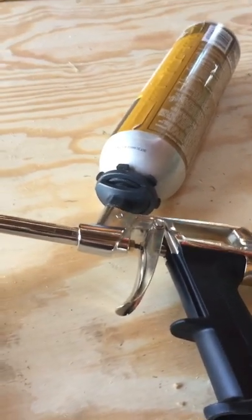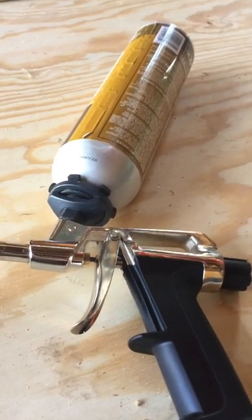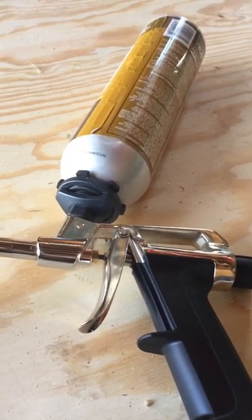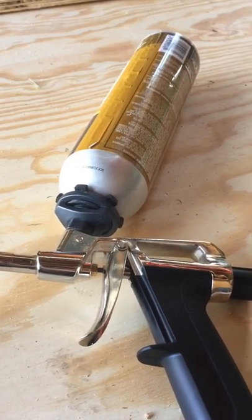This polyurethane product is a lot stronger than your typical caulk gun style, and the longevity of this bottle has lasted — it just goes and goes and goes. I've been using it for my tripled-up 2x12 beams that my floor joists sit on, and gluing down all my plywood sheathing for my attic loft flooring, and it has lasted forever.